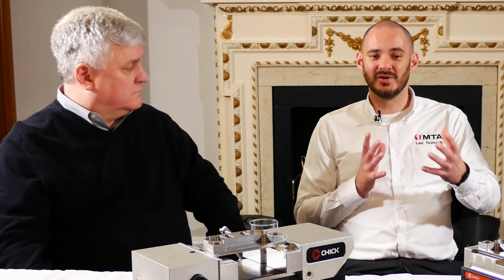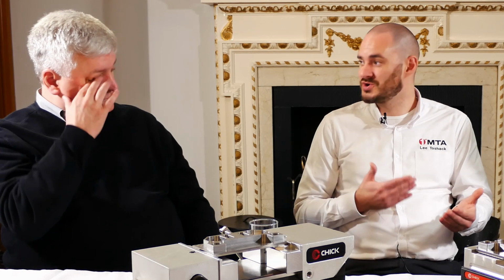Like when you're attaching work holding to a column on a horizontal machine, you're getting further away from your point of contact and your gripping forces. Whereas if everything's solid and attached at the base, and it is the actual base of the pallet that is holding everything strong, and then you've got that squeezing technology on your jaws, you're just creating a solid, sturdy environment. It's a very rigid system. It would need to be because it's only supported on one end. Right, exactly.